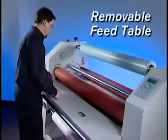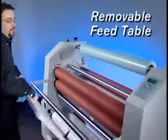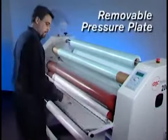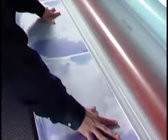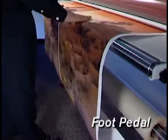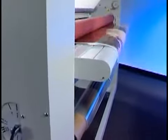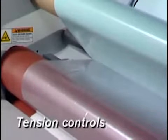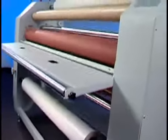The rewinds are positioned to accept release liners from PSA film and AccuShield and to accommodate finished output. The lightweight feed table on the front is removable for better access to the lower film shaft when webbing up the machine. A removable pressure plate can be installed to ensure even pressure along the leading edge as it enters the nip rollers. The foot pedal can be easily positioned on either side of the machine for hands-free operation, and the finished product can roll smoothly onto the take-up reel. Unwind and rewind tension controls are conveniently positioned for quick adjustments.